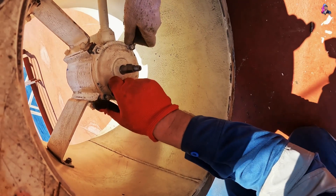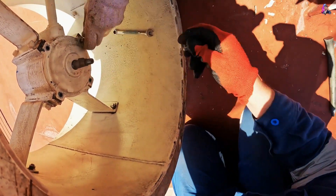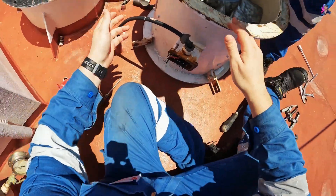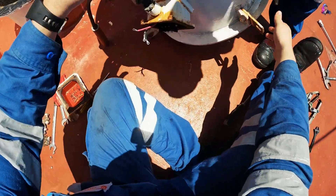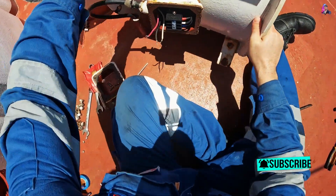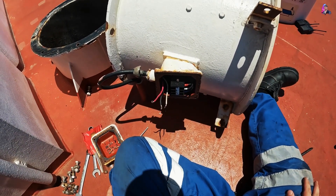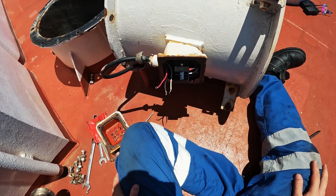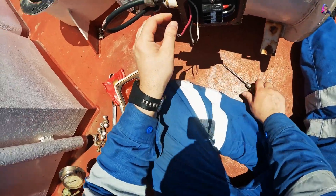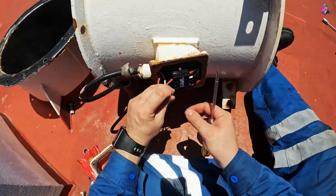The captain was kind enough to give me the cadet, so I got to work. I disassembled the motor to see what was going on — I expected a bearing problem, because usually when there's noise it comes from the bearings. The ventilator had already been stopped for about two days. After removing the mushroom cap and going inside the tunnel, you saw at the beginning I shone the flashlight in there, because sometimes you can find bird nests in there. And if you start the ventilator after that, you can imagine what would happen — no need to be too graphic. So if the ventilator is stopped and you have work like this, I suggest checking the tunnel for wildlife first.